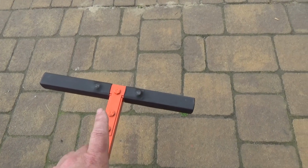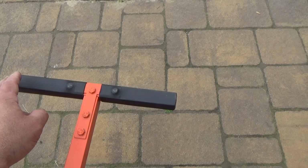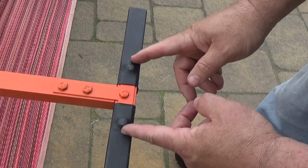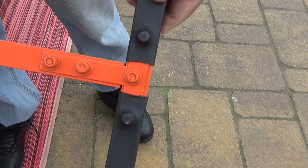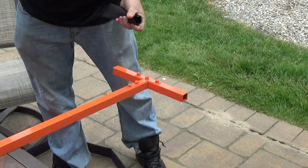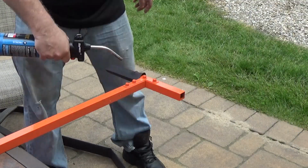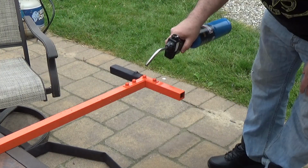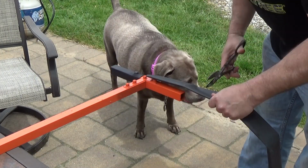And the last thing to do is to make the handle. I cut a foot off of the 8-foot-long 1-inch square tubing. I put a T-bracket on both sides of the handle and secured it with some 1/4-20 bolts. Then I added a 1.5-inch heat shrink tubing. I cut them 1 inch longer than the handle so I can tuck the overhang ends in the inside of the handle.